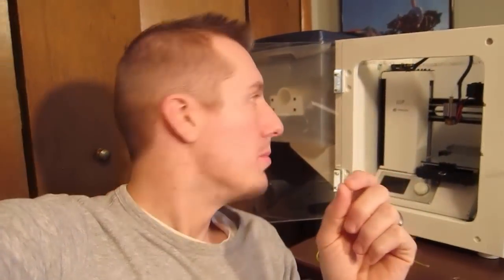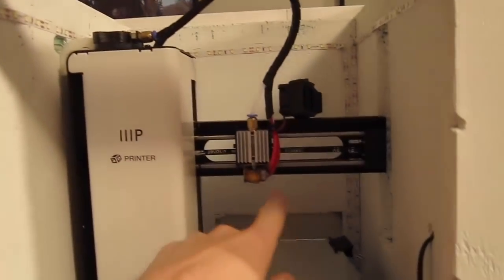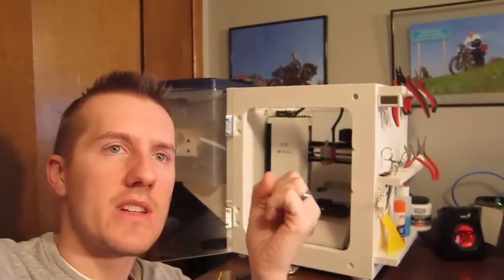Once I get the new nozzle I'm going to screw it back in place and see how it goes. I also read that people used filament lubers — either at the top or before the filament goes into the motor. There are different designs, screw-on or snap-on, where you put a small sponge and apply olive oil, 3-in-1 oil, or canola oil — anything that lubricates without smoking at high temperatures like 250 Celsius — to help lubricate the filament as it goes through.